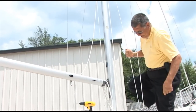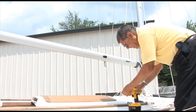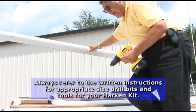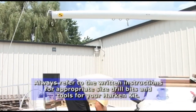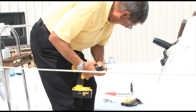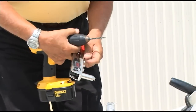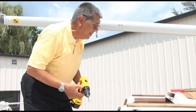We have to fix the strap in the back, and for that I'm going to need a 13/64 bit, because I'm using rivets for this strap eye. I'm going to take my number 29 out and put my 13/64 in. These rivets are stainless steel — very tough, extremely strong — and they require a good deal of muscle to install them.